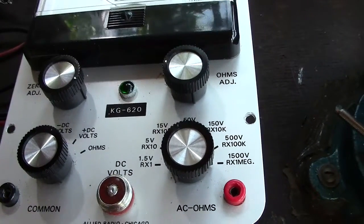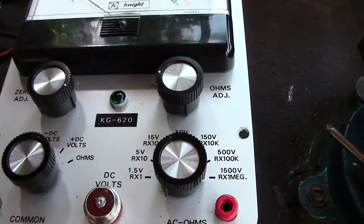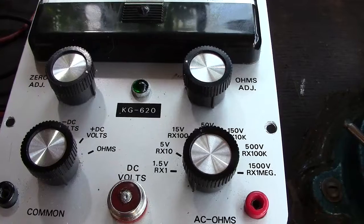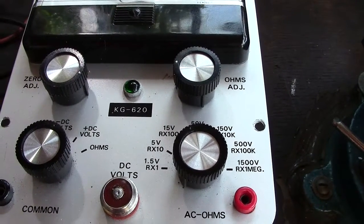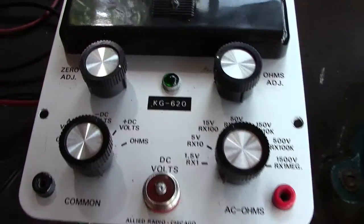Anyhow, the mystery was still not solved. I turned it over and tried it out. Now excuse me getting into a bit of a mess here, turning it over. Now there's sets of control knobs. I came to the conclusion this is not an ordinary voltmeter. It's in fact a valve voltmeter, which means it would be high impedance to the circuit using the meter, which meant that normally a meter might be 10,000 ohms per volt, but using valves this would be much more. It's a fairly old unit, but I am well pleased, and I've tested various bits and pieces.